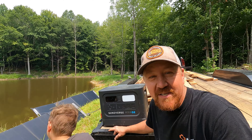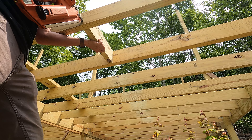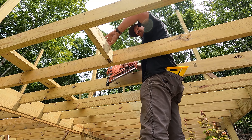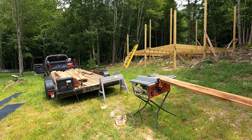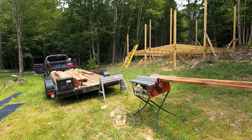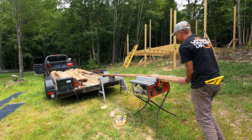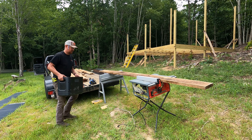We are set up here today because we've got a little bit of time to work. We've got some floorboards — red oak — that we're going to put in, but first we had some suggestions to put in blocking between the floor joists. Several people mentioned we needed to use joist hangers, but I went to Lowe's and they were over two bucks a piece — that's a couple hundred dollars just for joist hangers. So my plan instead is to find some solid rough-cut boards and run them along underneath the joist as a ledge for the joist to sit on, kind of serving as a joist hanger but saving me a couple hundred bucks. We're going to do that blocking and put in those joist blocks first, then get to work on the floor.